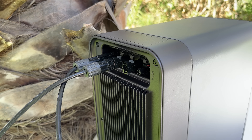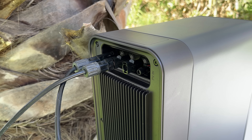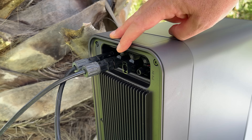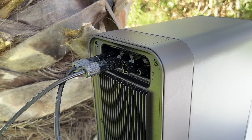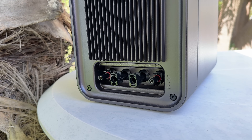There are two separate circuits at 500 watts each. I'm only using one for demonstration since I don't have a second free panel. The bottom area has four output connectors rated at 800 watts max — this is where you plug in the included cables to connect to your micro inverter.